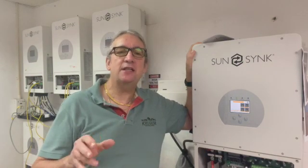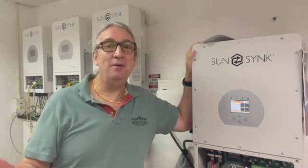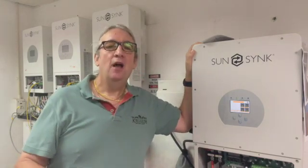You can draw six kilowatts off-grid per phase, which would basically mean it'd be like an 18 kilowatt inverter. If you're on grid, you can take a hundred percent off any phase, because it will take part of the power from the grid, pass the power through the batteries and inverter. So if you had a peak power demand of 12 kilowatt on any phase, no problem.